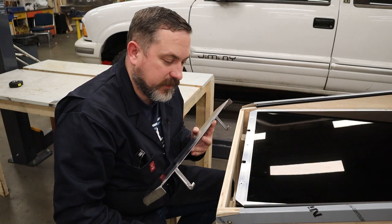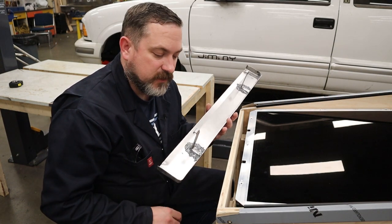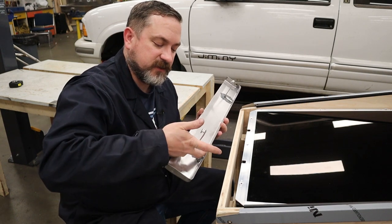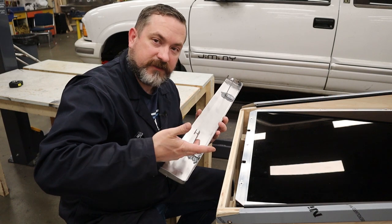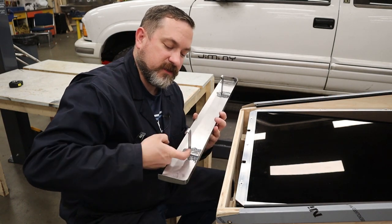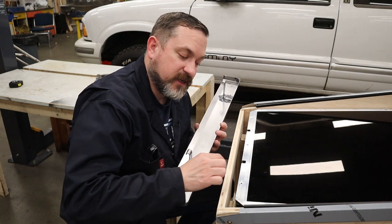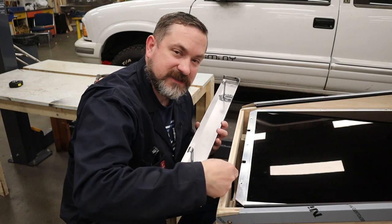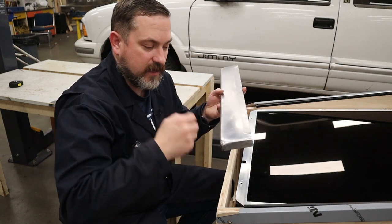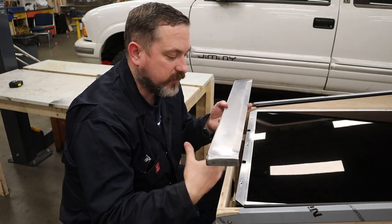So I hummed and hawed about what would be the best strategy, and then I came up with something. If this lip sits on the outside of the cabinet, we just need something to make up the difference in here before the edge of this J-hook. If I measure from here to here, that's 1.5 inches. This is 3/4 inch plywood. So if I add another piece of 3/4 inch plywood on the inside here, that will hit here. And so the edge of that J-clamp actually acts for locating and keeping it this way.